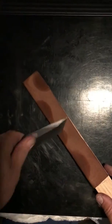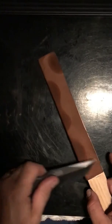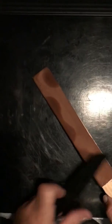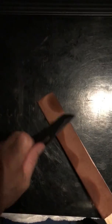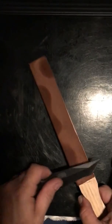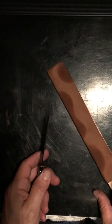So again, as we said early in part 1 basic, what's the intent of the knife? Is this for kitchen stuff? Is it a surgeon's scalpel? Is it going to be for cutting boxes and wood? Depends on what you plan. If this is for a super high quality kitchen knife that only slices prosciutto and paper thin slices of onion and tomatoes, yeah, you can do 11 or 15 degrees and just keep stropping down until you can drop a human hair over it and watch it split over. That would be totally fine, not a problem.